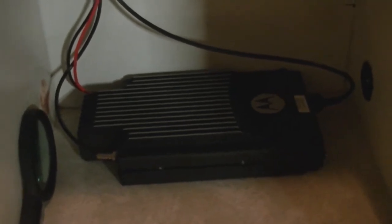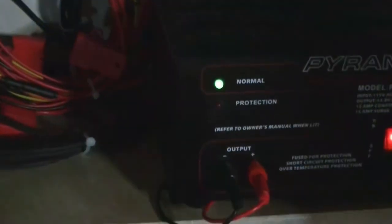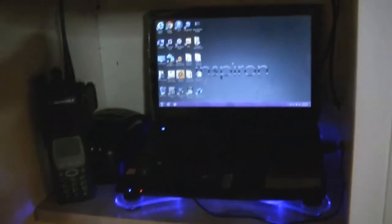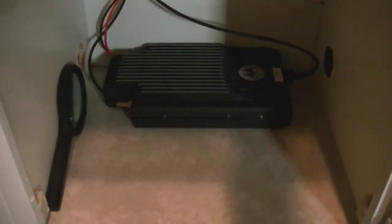All I'd really need to do in order to switch them over is just unplug the data cable. I'm still trying to work on the routing and things like that. On this side I have just two holes to route wires through if I need to. All the cables route through, and I've got a spare cabinet in the bottom here. The laptop is for programming — I run the programming cable up through the top, program it through the head, which in turn programs the radio body. So for a remote head installation, it's not too bad.